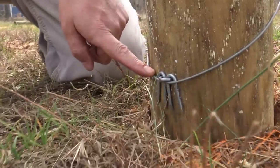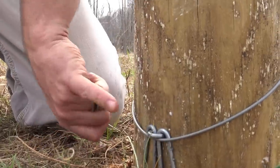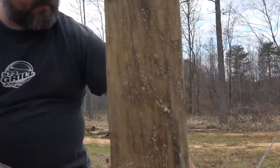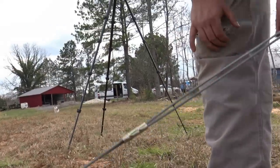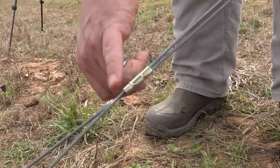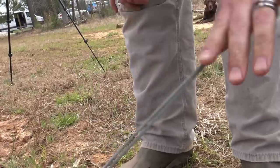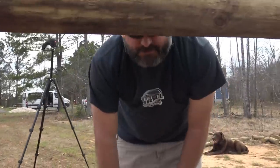Right here, you want to drive a staple, and then drop two staples in to keep this wire from cutting into the post when you put tension on it. You do this first before you put your wire up. This here is what I just call a crimp ferrule. There are several different types made. I like this particular kind because I can get three to four crimps on here and get a real good bite on the wire. I slide this down to keep animals' feet from sticking in it.